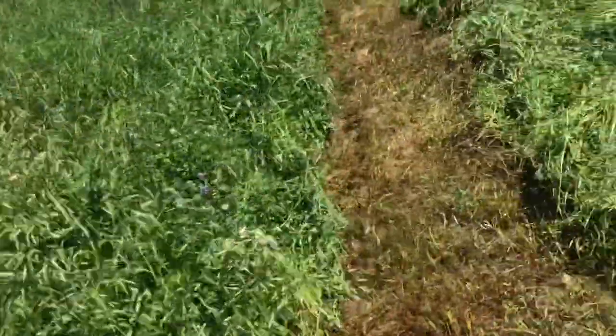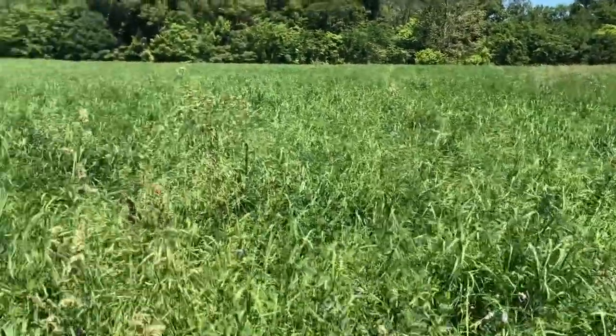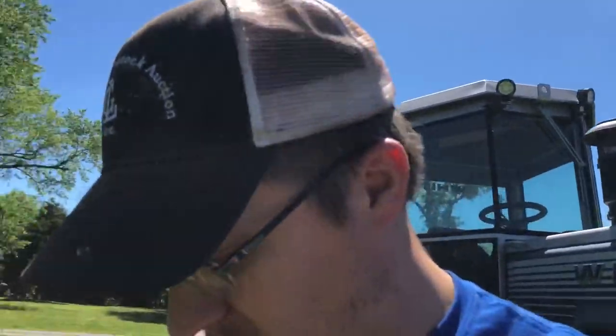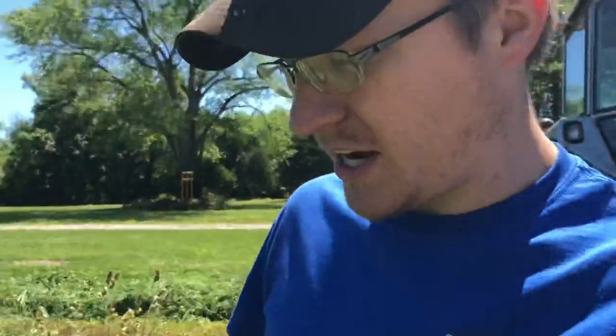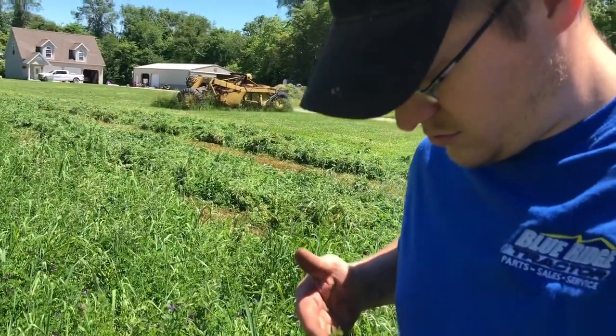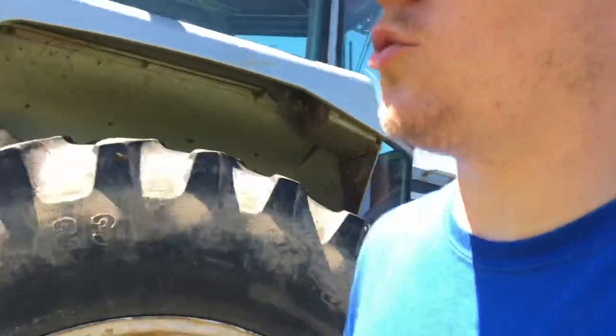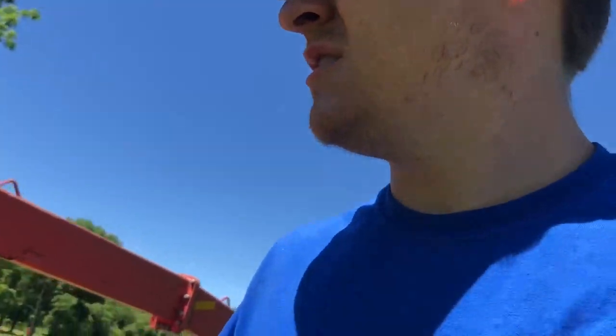Give you guys a little view of the hay. Just for reference — I know height doesn't have a whole lot to do with it, but I'm not a tall guy, I'm only 5'8", 5'9". Here's the orchard grass. Here's a sprig of alfalfa that didn't fall down — it's up to just about chest height. It's a little far along, but you've got to work with what you're given as far as the weather goes. So the way you adjust this: the further this way you go, the more it tilts the header down; the further back you go, the more it tilts the header up.